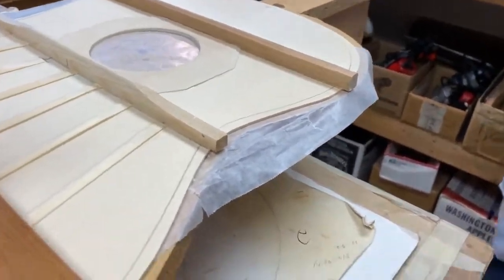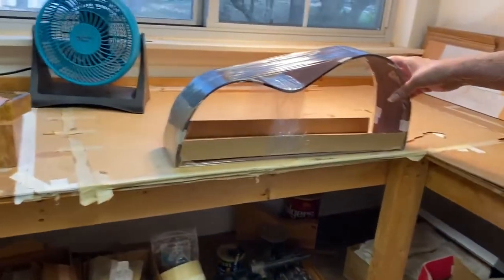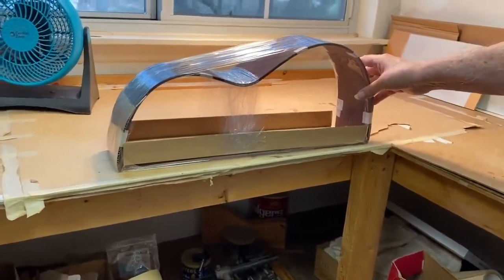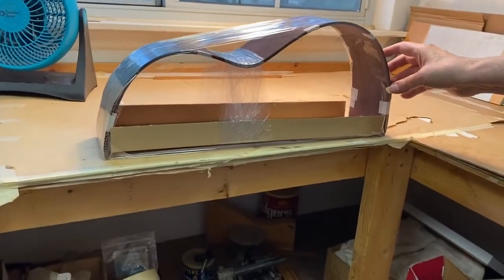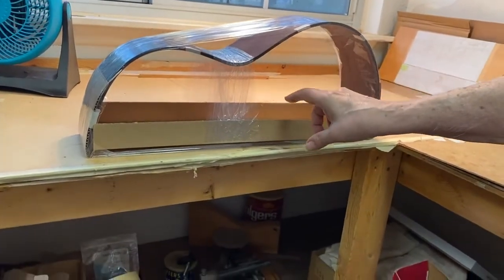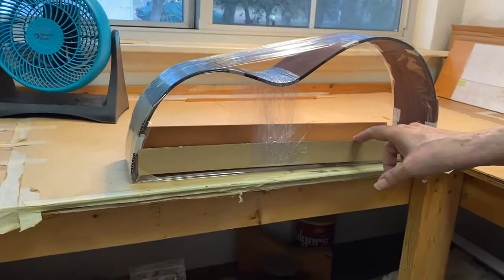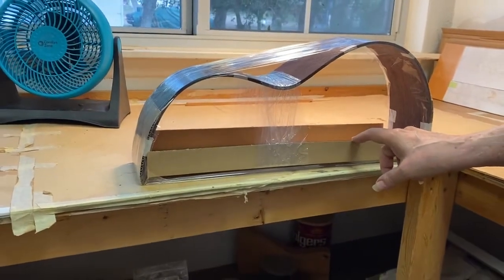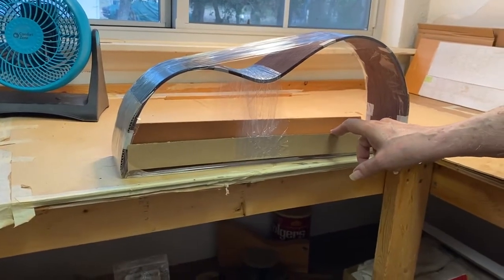And the sides are over here. And in answer to Ricardo, who asked me about spring back on the sides, LMI sends the sides bent like this, and it holds it in a mold until I get ready to use it. Now obviously there'll be a little spring back, but I can correct that on a little hot iron if necessary.